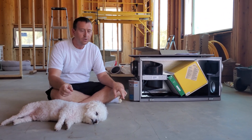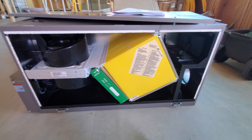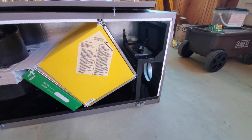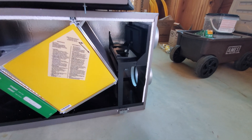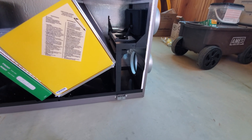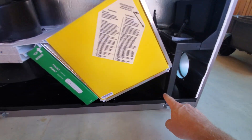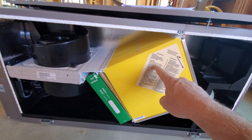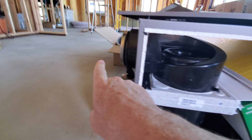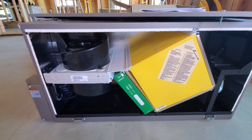Let's go in for a closer look and I'll show you how the machine works. Here we are taking a closer look inside. Imagine you're some stale air from inside — maybe from the bathroom. We'll collect air from different points, but more details on that once we install the ducting. The stale air from the building comes in this side, goes up across this kind of heater core, and then gets exhausted out this port to the outside.